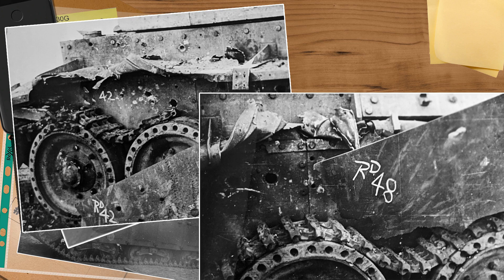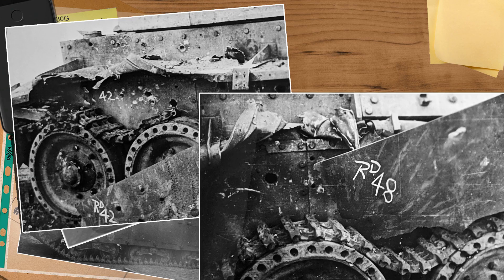The final conclusions were that the spaced array was effective against the PIAT except at zero degrees on the upper hull side. It was somewhat effective versus two-pounder Little John rounds at 30 degrees, reducing their effective range by 1,800 to 2,000 yards. However, it was not effective versus German 50mm armor-piercing capped high explosive, as those rounds still perforated the shield and detonated inside the tank, offering only an effective 300-yard decrease in performance.